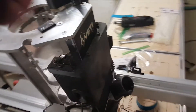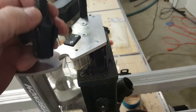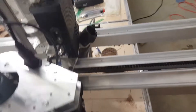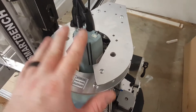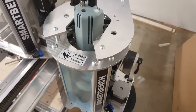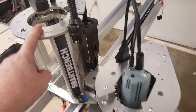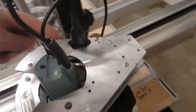The new head has a quick plug at the top for power, whereas the old one was hardwired into the back for the A&B spindle. We're still selling the A&B spindle as our base standard unit, but some people wanted more power without going to 220V. We've contracted to have this Yeti spindle made for us with our name on it. The A&B spindle does still fit in this Z-head — just need to sort out the connections, but that shouldn't be a big issue.